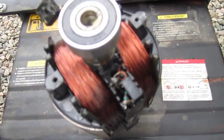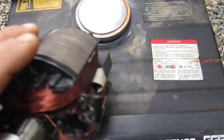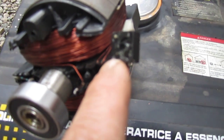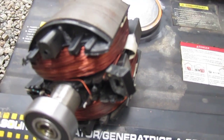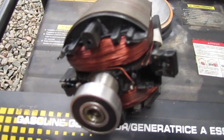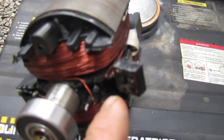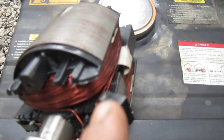It's not the bridge rectifiers themselves that actually go bad. What it is, is that either through vibration or whatever reason, the wires separate themselves. You can see the wire here — it breaks away from the bridge rectifier. So basically it's losing its connection, and that's the problem. I already ordered some of these little bridge rectifiers; they're very cheap, a dollar something a piece on eBay. There's another one on this side here — only two of them are actually used on each side.